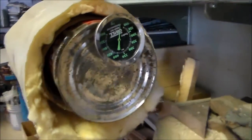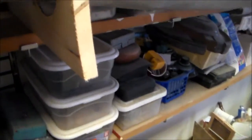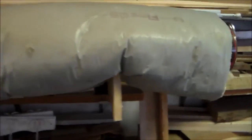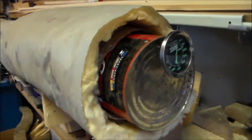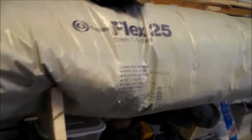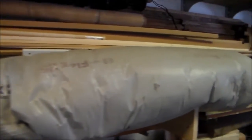It's a perfect fit — I couldn't have made one better. There will be moisture dripping when you're running the steam box, so I leave the back end open with a container underneath to catch the dripping water. I have the box sitting on my wood rack attached to the back of one of the shelves, and the front end where the door is sits about two inches higher than the back, so it all leans toward the back and drips out into the catch container. It's small enough to remove and stays out of the way against the wall where I store wood.